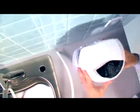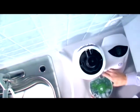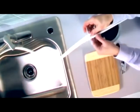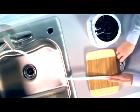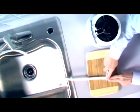Place the unit where you'd like it on the counter, where it's close enough for the tubes to stretch from the tap to the unit and the power adapter can plug into an outlet. Take the cover off of the unit, then remove the clear electronic module and set aside — not too far, though, because you'll need them later. If the tubes are too long, you may use a sharp knife to shorten them by cutting the tubes at the same length where the tubes are not bonded together. The easiest way to find a spot is by gently pulling the tubes apart to find where they separate. Be sure to cut a very straight line so the ends of the tubes are flat.